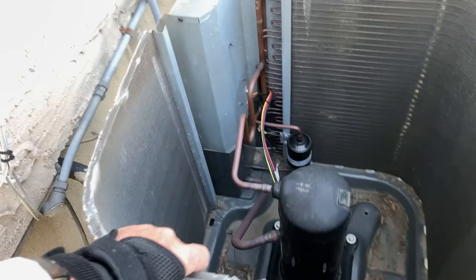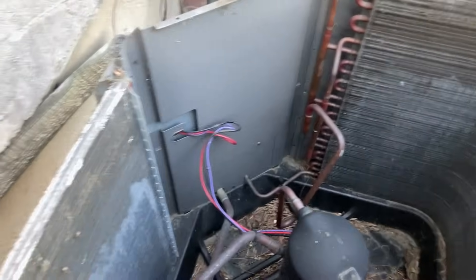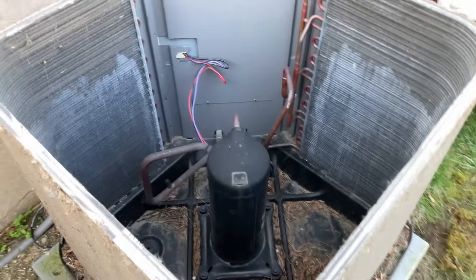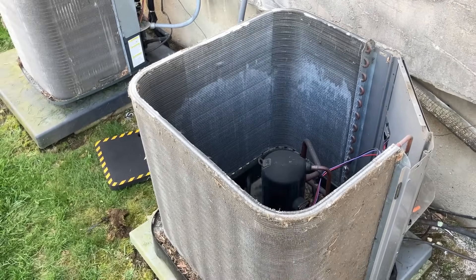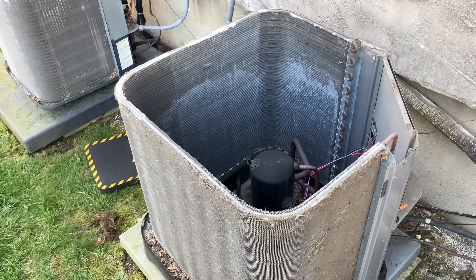It's a single-row coil looking pretty good on both — no flaking on visual inspection, just some dirt. That white residue we'll document in our House Call Pro CRM app, make note of it, and monitor it with pictures at future service calls.